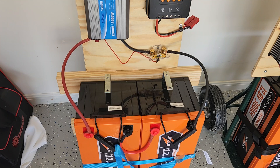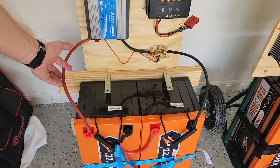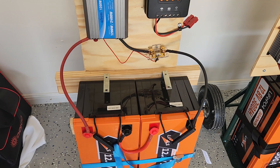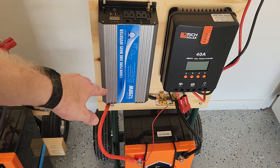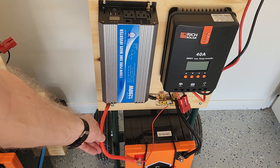I don't have to worry about it getting hot, so I get to save money on my wire size. This is both a cost saving measure and also a safety issue. If you watch my test video on my 12 volt 300 amp system, I noted that this wire was starting to get a little warm.